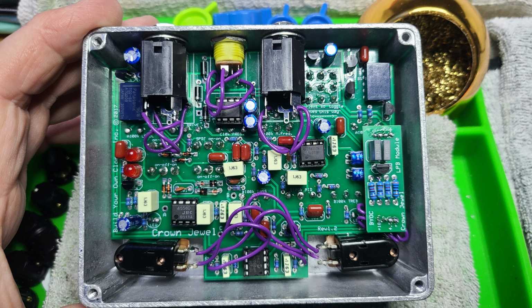Okay, so I started putting the printed circuit board back into the chassis and putting the washers and nuts back on to lock the board into place while the input jack and output jack were still out. The foot switches were still out. Powered it up, got signal, awesome. So I put the input jack, output jack, and foot switches back in. Power was still out. Powered it up. That worked. So then I unsoldered the power, put the power barrel into the chassis, wired the power back up. It worked. Still had the same signal.